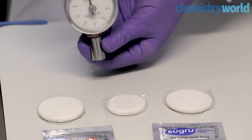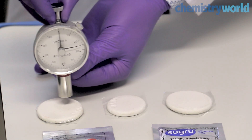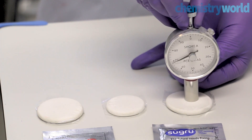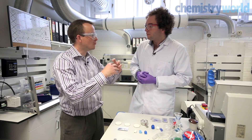If we take a look at some samples, I can take a durometer and as you can see here we get to around 30, then about 40, and that'll be Sugru in its normal state of 70 Shore A. So this sample has the most softener in it, which makes for some really exciting applications — especially coming from design where you want to create different prototypes of rubber handholds. With a drop in Shore A hardness, it's much more flexible and spongy. Although Sugru in its normal state is almost a little bit softer than a car or bicycle tyre, we can take this down to elastic band style squidginess.